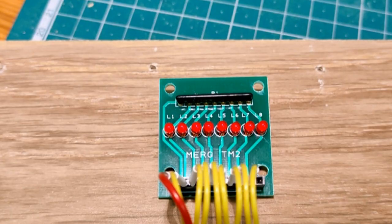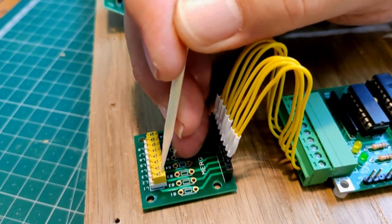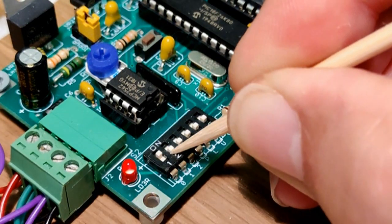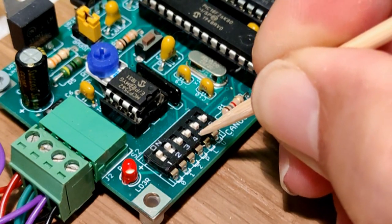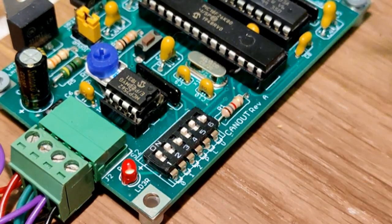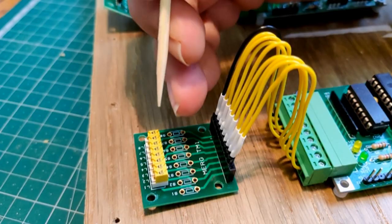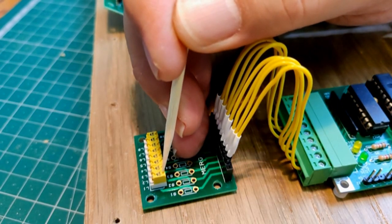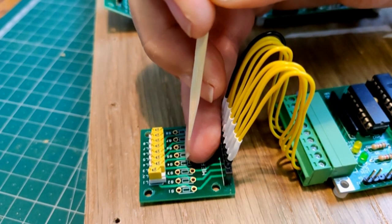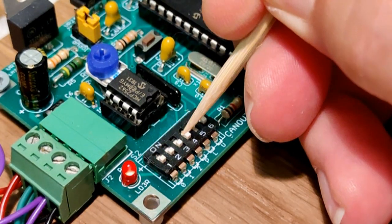However, I also want output 5 to operate with input number 1, but as the inverse of output number 7. Output number 5 is set up on the selection switches, and the Learn switch is set, but the polarity switch, labelled P on the PCB, is also switched on. I turn on input 1 again, and the CANOUT configuration switches can all be switched off again.